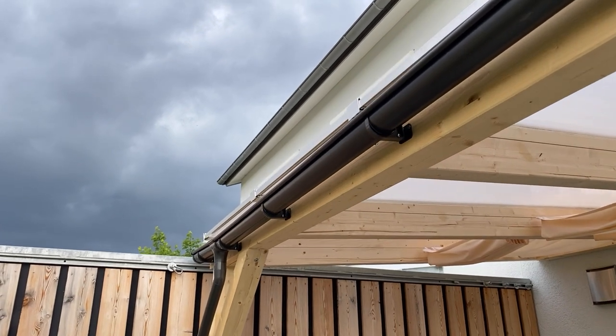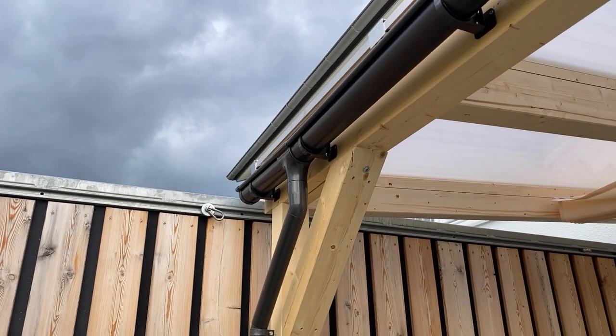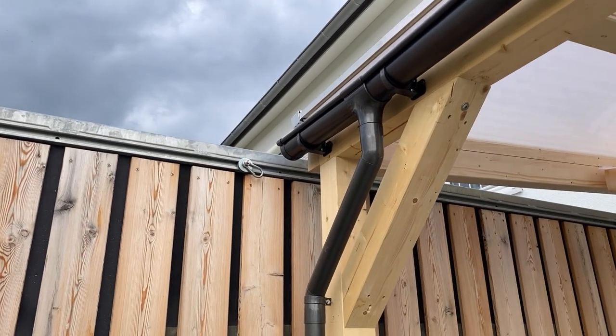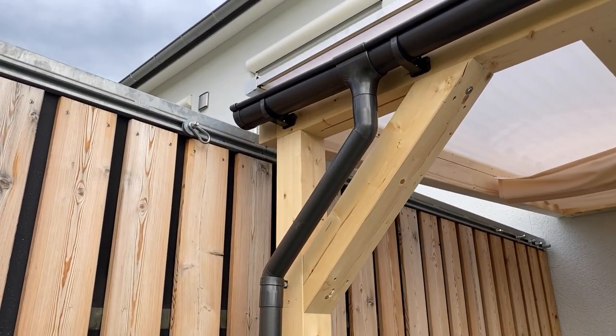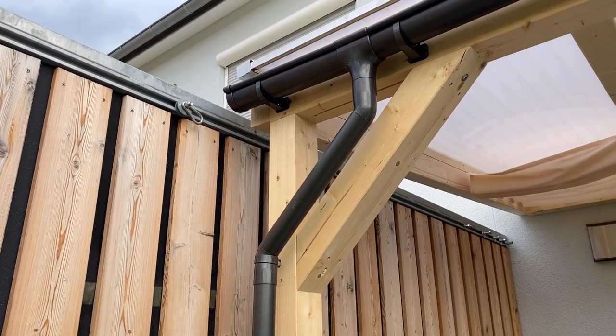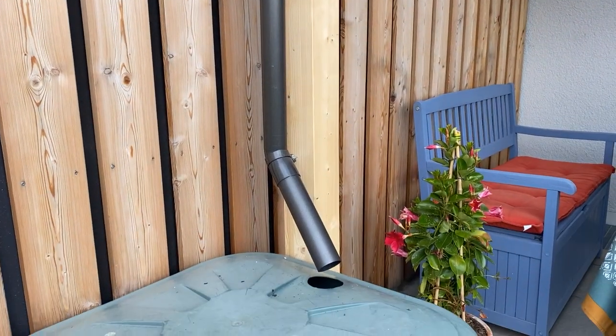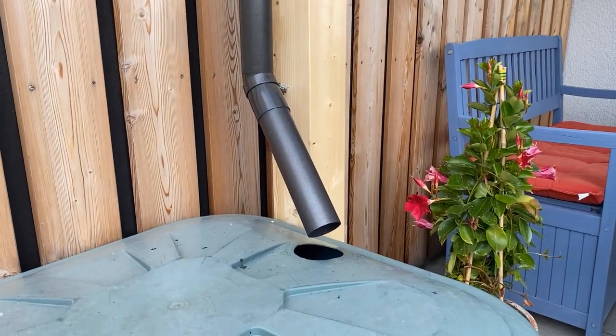Now we're installing the gutter - this will be child's play. The great thing is that with our front Rähm I'm completely independent from the rafters, so I can place the brackets wherever I want. It's standard half-round 70mm pipe available at any good DIY store. I chose 70 cm bracket spacing with 2% fall: over 3.5 meters that means 7 cm height difference. Here at the front I left some clearance above to clip in the gutter, then each subsequent bracket goes 1.5 cm lower so at the back I'm almost at the bottom edge of the Rähm. Easy system - even a non-roofer can manage it. The gutter is clipped in and the downpipe runs beautifully at 45 degrees, just like the head brace, down to the water butt.